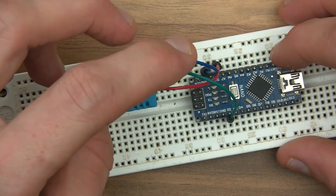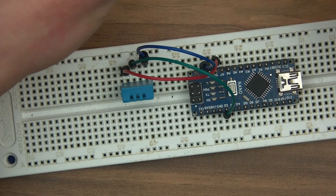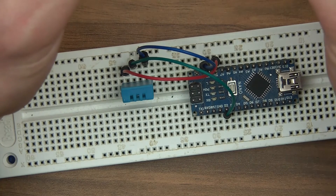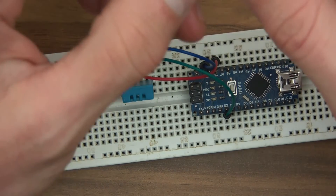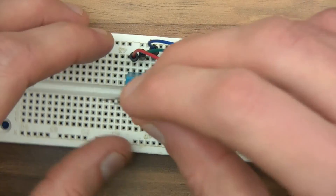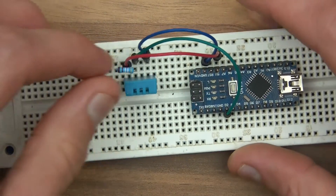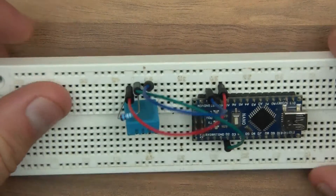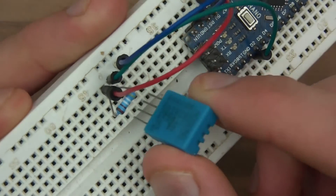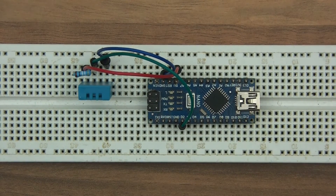So very simple: VCC, sensor out, nothing, and then ground. Now there's another thing we need to do. According to the datasheet, we need a 5K resistor — and this is a pull-up resistor. Things don't work properly if you don't use the resistor. I've heard that the newer ones actually have a pull-up resistor built into them, but this one doesn't. Basically what we have to do is join VCC to sensor out, just with a resistor. I'll pull this out to show you — so that's really easy. And that's how to wire up your sensor.